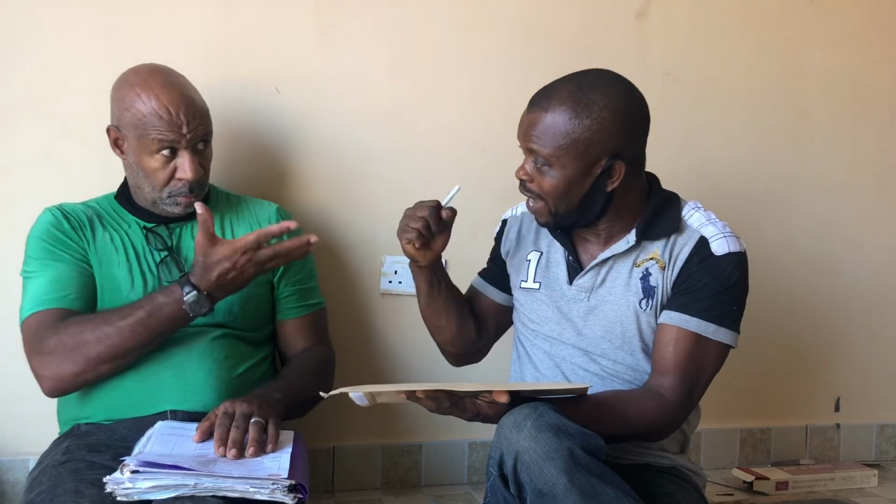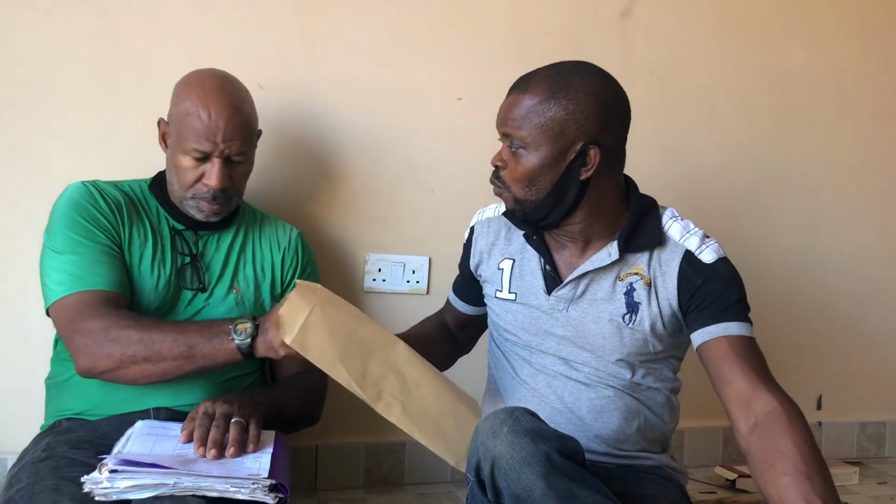But when you cast a foundation, you leave it for a period of time to dry. The period of time would be 2 weeks maximum. So 2 weeks curing time, plus the 3-4 days of the other stuff, add up together. So basically, 3 weeks, almost a month.